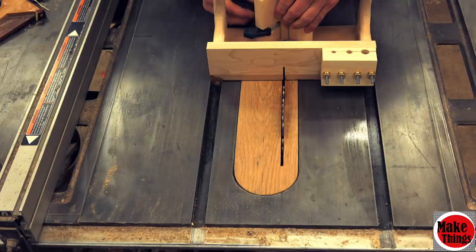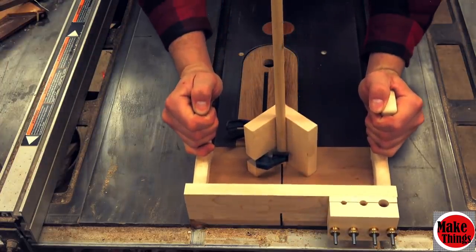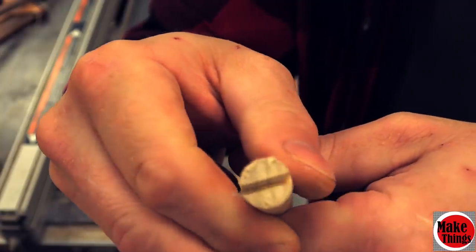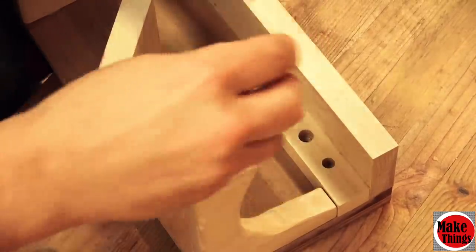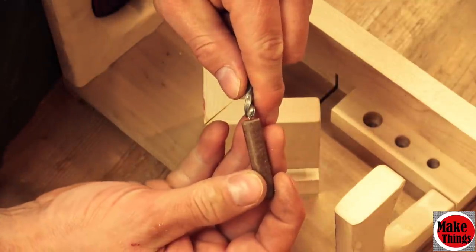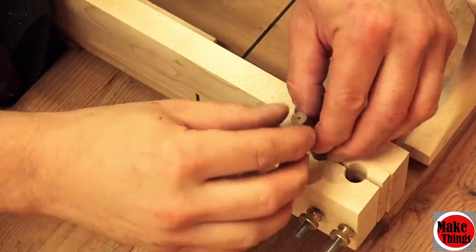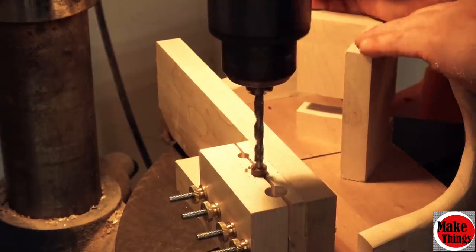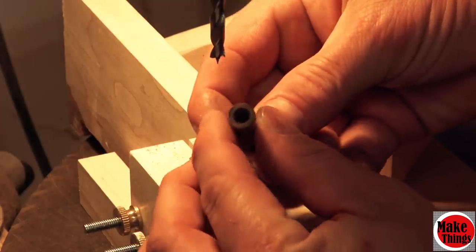To cut the split dowels, it's very easy — all you have to do is load in a dowel, apply a clamp, and run the dowel jig forward cutting into the dowel. If you find the dowel is moving, you can always add sandpaper. This is the final product — there are so many different future design ideas I have for this, but I really like how it looks on my project, like a flat-head screw. To make the double dowels, insert the dowel on the right-sized hole pressing down to make a slight indentation. Next, use a brad point drill bit to carve out the shape of the point, which makes it easier to center the dowel. After that, insert it into the clamp, tighten it up, make sure the bottom of the clamp is supported, and drill down deep enough to add about a quarter-inch dowel into the space.